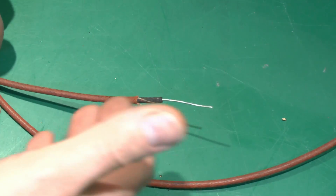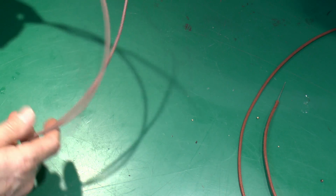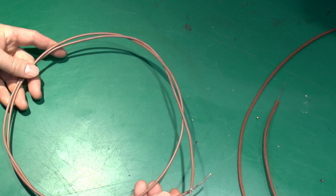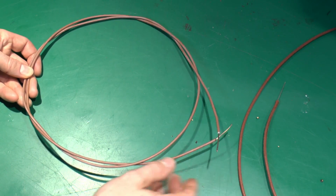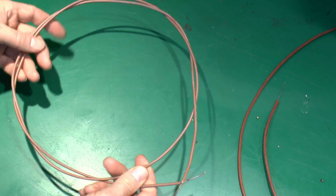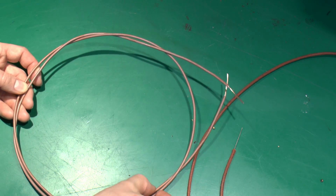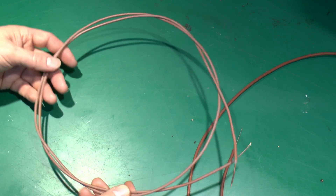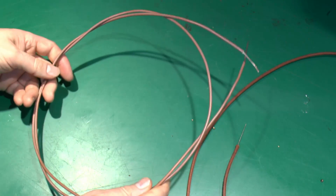That's really the problem with this stuff — it may seem fine when it's in the walls, but at any joints or terminations, as soon as anything moves slightly, it just crumbles apart and you're left with bare wires. Now what we're going to compare it with is this: a modern cable taken out of a twin-and-earth type cable, with brown PVC insulation and bare copper inside. It's a similar size to the rubber cable, though this will be an imperial size so it won't be an exact match, but pretty close in actual dimension — just standard PVC with a fairly matte finish.